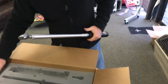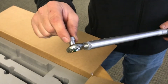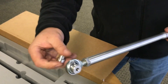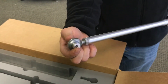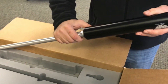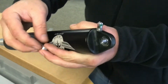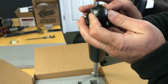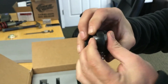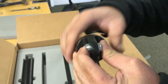Now that you've got your assembly together, we have reducer bushings for some applications; some applications use a through bushing. This bushing goes into this side, and this bushing goes in the other side — that's ready to go into your lower mounting location. For the upper mounting location, you have two bushings to take up the difference. Put one on each side of the monoball or eccentric bushing and slide it into your cabane V.